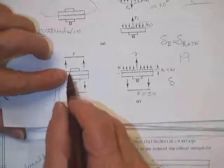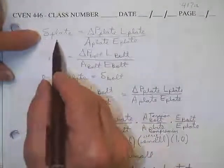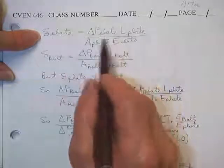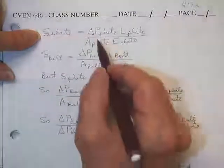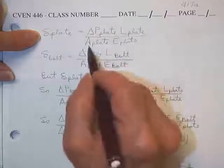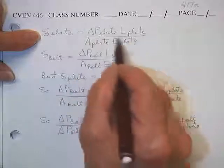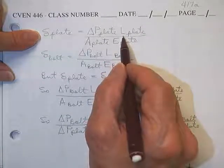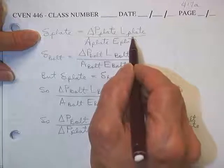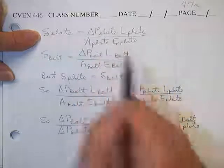I have equations for delta B and for pieces of steel with thickness T or L. The deflection of the plate is equal to PL over AE — subscripting it: deflection of the plate, length of the plate, area of the plate, E of the plate. This is the area of the item under compression, the property of the material being connected, the thickness of the plate — that's how long that piece of steel was, how long that piece of T on the flange was.